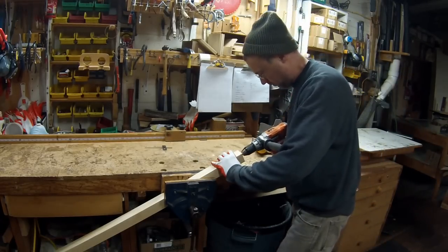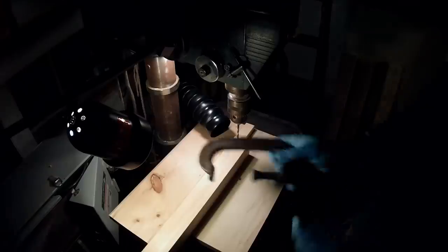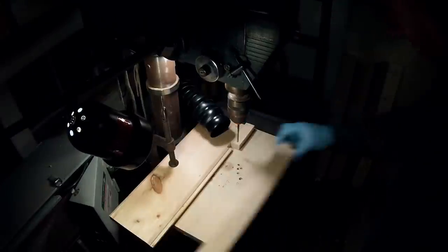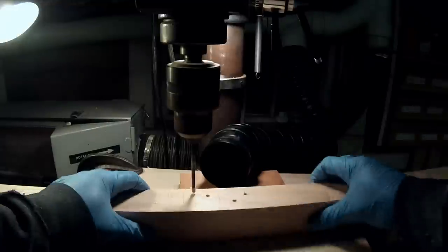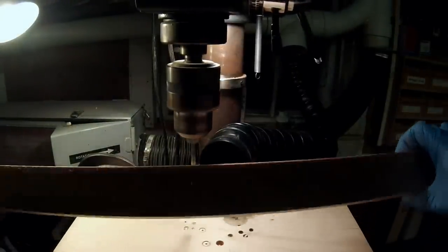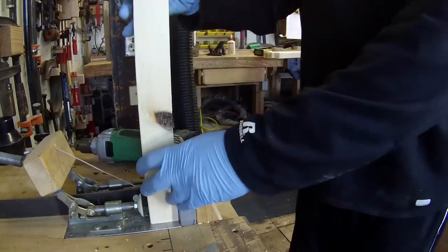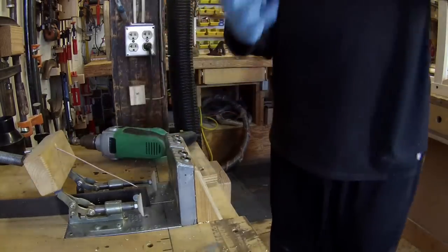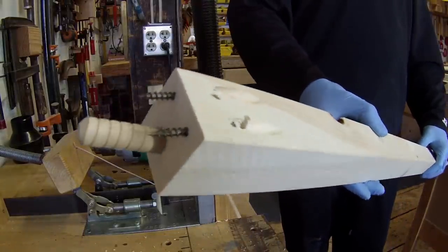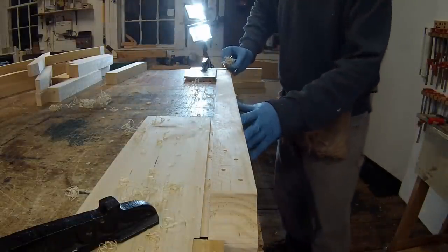The metal drilling bits tend to wander if you start a hole with them, especially large bits. Here I'm on the drill press with a 3/16 drill bit, pre-drilling a bunch of holes where all the frame members are going to line up. These are the pocket holes that go on the main frame members with the dowels — I'm doing a combination dowel and pocket-hole joint, which is actually a very strong joint. Here I'm just chamfering the corners with a hand plane.